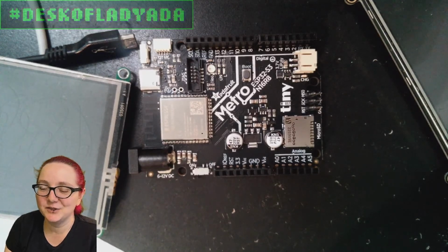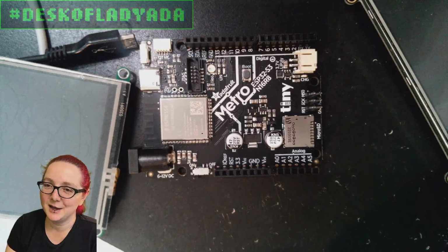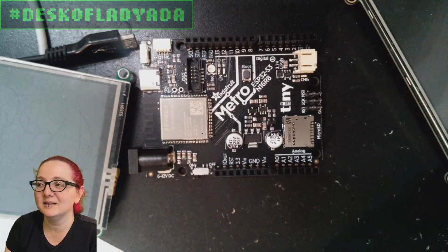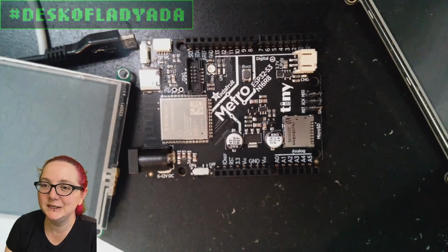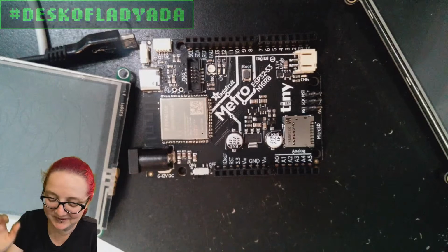I love the ESP chips, but you really have to watch out for those strapping pins. They expose pins where, if you actually use this pin, really bad things are going to happen. I've noticed that they've stopped doing that on modules. If a pin is used internally, there's really no reason for you to have access to it, so they don't give you access. Lesson learned.